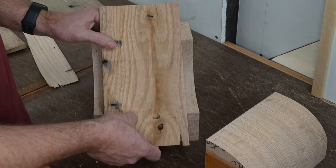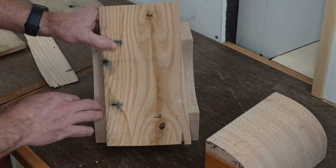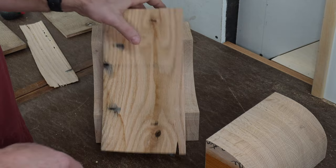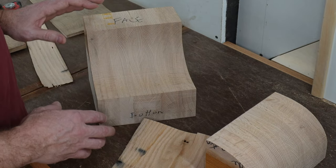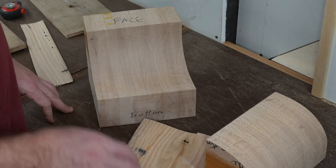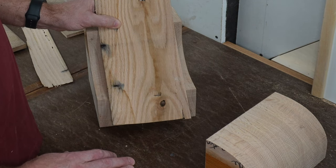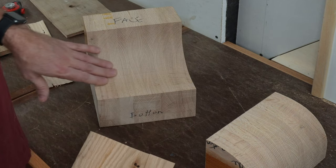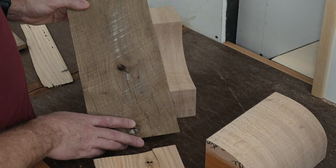So I'm only going to be able to cover up that much, which is okay because I kind of planned on trimming off the outside edges anyway and replacing it with full thickness barnwood so that I'd have barnwood on both sides. So if I choose to do it this way, there'll be a glue line here where the outsides meet the lamination inside, but I think I can work at that to kind of blend it in, and it'll be less noticeable than all these lines. Plus it'll already have the aged wood appearance and I won't have to try to do the color matching. So it's definitely worth a shot.